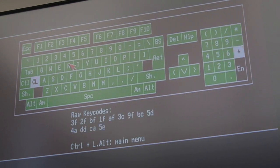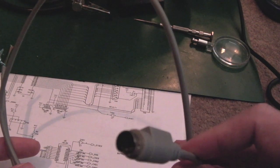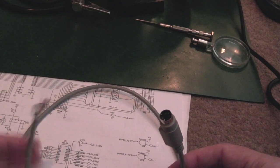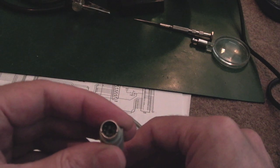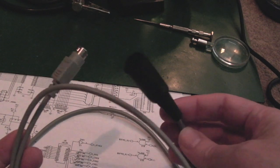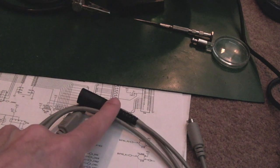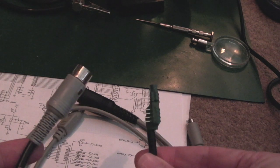So, a nice easy way to get a keyboard on an A4000. As I mentioned, buying a cable like this means you cut it in two and you've got enough to make two adapters — it's a six-pin mini DIN to six-pin mini DIN straight through. There's our final adapter — would have been better with a grey housing, but I've probably got one somewhere.